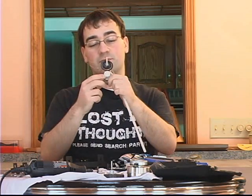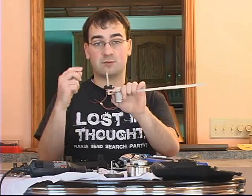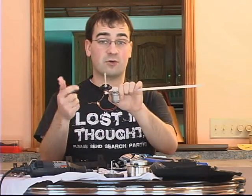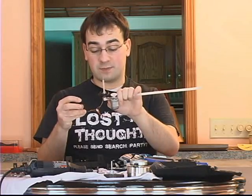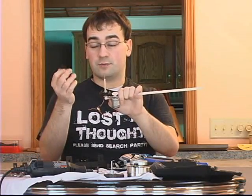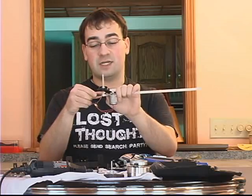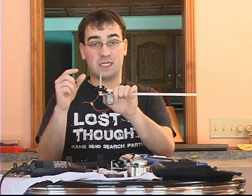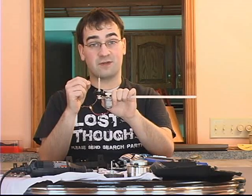I'm still having some problems with the meshing of my gears. I've got them pretty accurate but the gear on the fan is still flopping around a lot. What I'm going to do is take the teeth from the other playhead gear and glue them onto the back of this to effectively double the amount of area on the main gear that attaches to the fan.